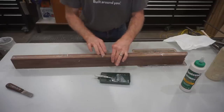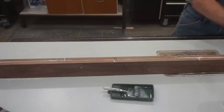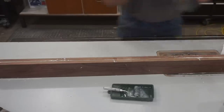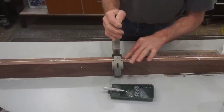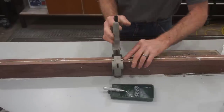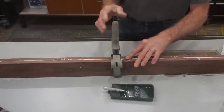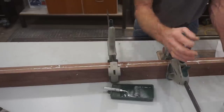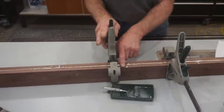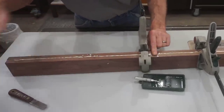And this is kind of the show edge of the pencil. If there was an A and a B edge, this is the A edge, so I'm going to follow it most closely. Just start gluing this up or clamping it up. And if clamping pressure misaligns the faces, I just readjust it so that it ends up perfectly flush when the clamp is tight. Until the glue gets settled and evenly dispersed, these pieces can continue to move around. Even under pressure, I can always give it a little tweak at the end of the piece like this.